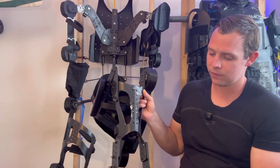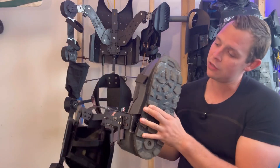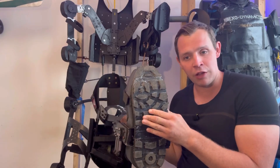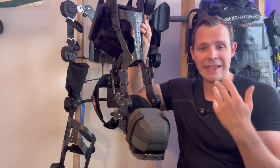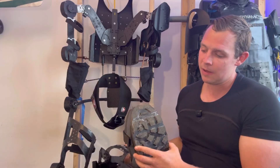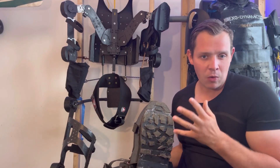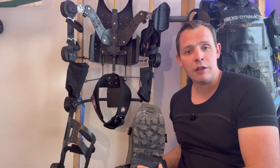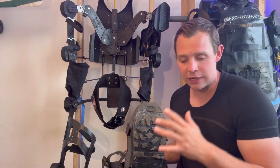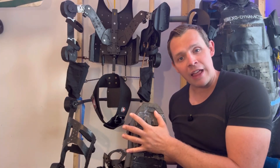My version of this on the power armor design is really in the soles of the boots. I've tried to keep these boots fairly modular so that parts can be replaced or upgraded depending on what is required. The sole underneath, which is custom made, can be bolted on and off with different methods of shock absorption. For example, this is quite a rigid version - it works quite well however it is quite loud. So I'm actually going to be working on a more silent version made primarily out of EVA foam with resin coated over the top to make a boot tread. That'll be quieter but not as resilient. But at the same time this could be unbolted and have a bigger tread fitted - for example if you're planning to use the suit in snowy conditions, you could just bolt a snow boot onto the bottom instead of relying on a clip-on variant.